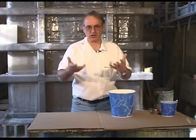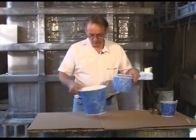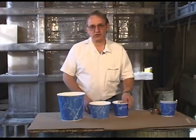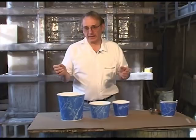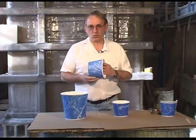So always, when you're doing your laminate, use brand new buckets that are designed for fiberglass. All of the buckets Rayplex sells, we've proven in our own shop and have used them over and over again for fiberglass laminating. They are safe, they'll work well, and you'll have no cross-contamination with your resin, gel coat, epoxy, or any other type of resin you want to use with them. Now, watch out for imitations. Some of these people may want to sell you a tub that maybe has a plastic or a wax lining in it. Wax will actually work its way into the laminate, and you may get some separation between the layers just through a little bit of contamination.